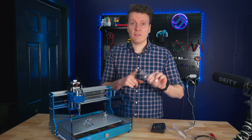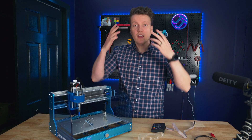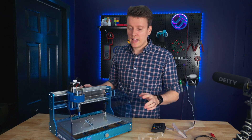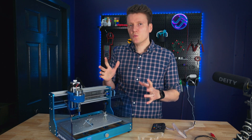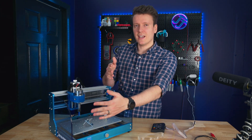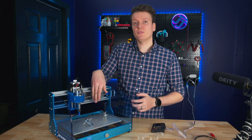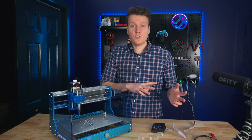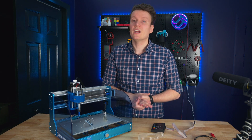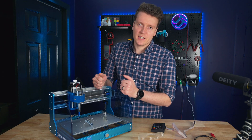Another thing to think about is how to keep yourself safe. Safety glasses are really the main thing you need when running this machine. You should also make sure you're back from the machine, hair is tied back if it's long, and no loose sleeves or clothing — this spindle spins extremely quickly and anything caught in it could end badly. I actually felt safer using this than a laser engraver. With a laser, there's an invisible beam that could blind you instantly if it bounces wrong, plus fumes you need to filter or exhaust. Here your main concern is the spinning spindle and chips flying off, so I kept a board in front of me just in case a small bit broke off.